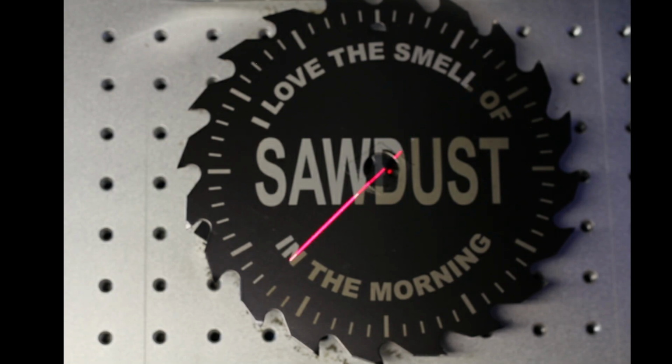By the time we were done marking this entire blade, it took about 2 hours and 20 minutes. We could probably knock that down by about an hour, maybe an hour and 10 minutes, by not doing as many passes, especially on the cleaning pass. There was a lot on there we did extra. And on the final pass, we didn't actually need to do that cross hatch plus the two passes. We could have just done no cross hatch and one single line up the screen. It would have turned the text a beautiful white.